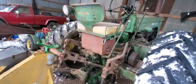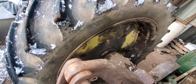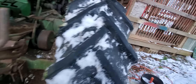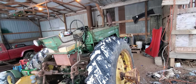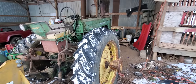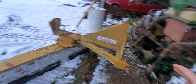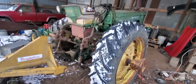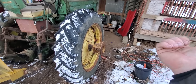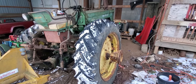That probably wouldn't be a bad thing with this blade, but I've just gotten so used to a blade staying centered behind you — I prefer that. Something else about this tractor: don't pay any attention to the greasy wheels and the twine wrapped around the axle, but these wheels are scooted all the way in. With the blade centered behind it and angled one notch to the side, I'm still taking an even cut, or maybe even just a little bit to the side of the tire. I like being able to scrape out my tracks when I've got a blade on the back.